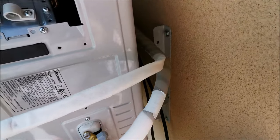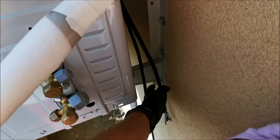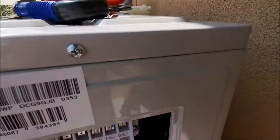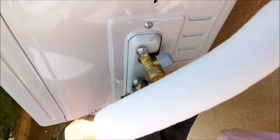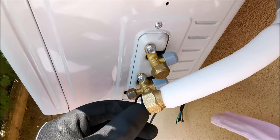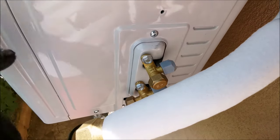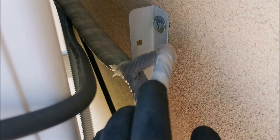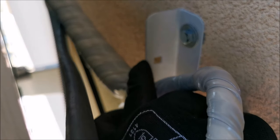We're preparing to make the connections. Everything looks good in there — we tightened those and put auto-locking nuts on them to make sure nothing moves. The cable length is perfect; the extended one I'll need to cut. We'll use ferrule ends on the wire. Remove the plastic covers from the pipe ends, insert the big pipe and tighten it, insert the small pipe and tighten it. Do not touch the two valve ends yet. Then wrap everything and use zip ties to hold it onto the brackets — they have pre-drilled holes for zip ties, which is a really nice touch.